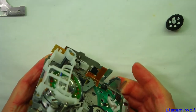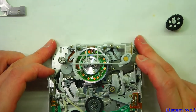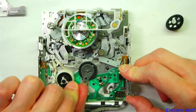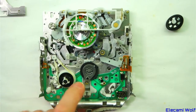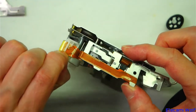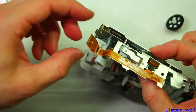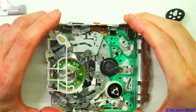Let's see if we can get the sliding piece off. We have to get this idler off first, which has some kind of circlip split washer thing — ultra tiny, down the hole there, I can barely even see it. The rigid part of the flex is gone all crusty and cracked off. The movement of that part is just this track here — there's a slot, there's a rod that goes down a slot, and another track that this business rides in, but it's a little bit bent.